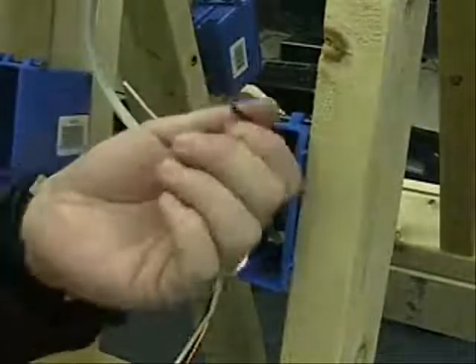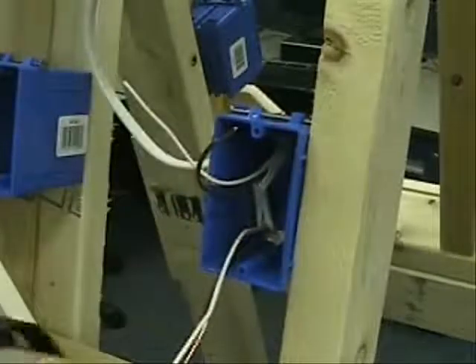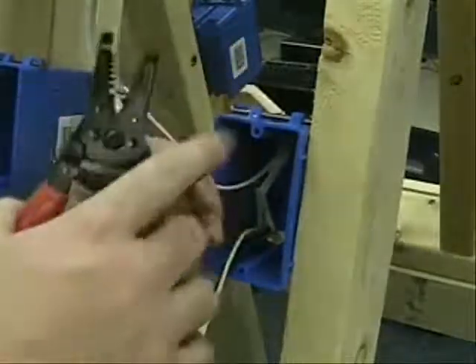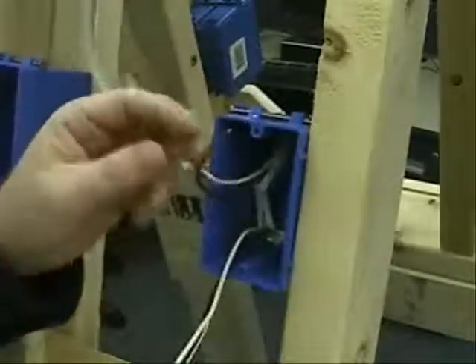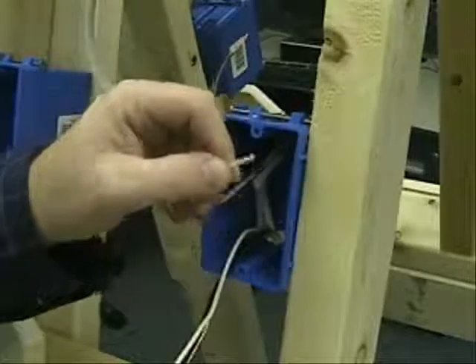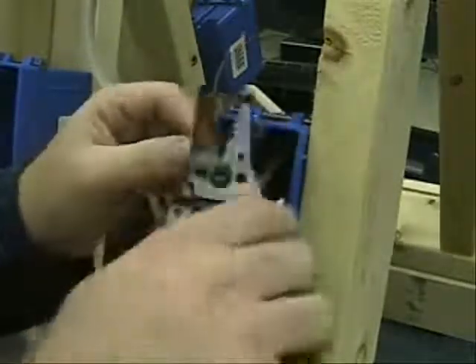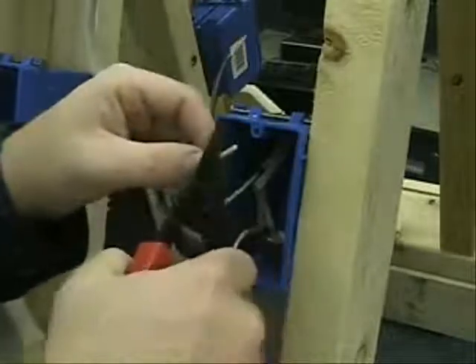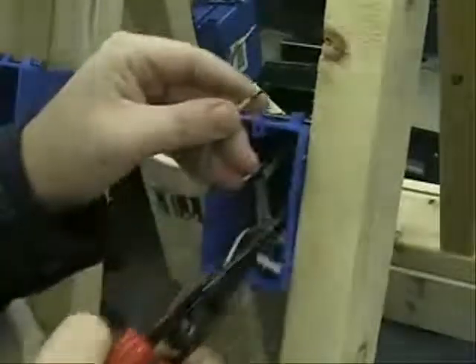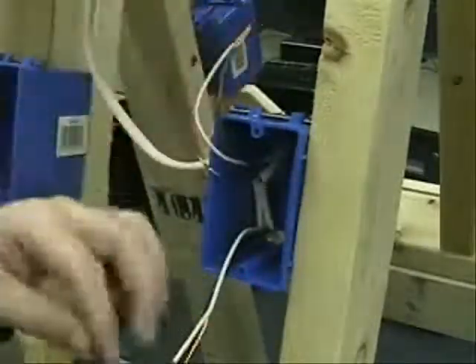Sometimes the insulation pops off, so that's why we have the safety glasses on. Try your best to drop all of your garbage right into the little tool bin built into the trainer. One other note: the end of this wire is very sharp — I've had many a cut knuckle and cut hand — so you really want to be careful when you're working with this. Once I've stripped that wire, I'll put it out of the way, take about a half inch on the next one, squeeze it between the strippers on the 14-gauge, give it a little wiggle, pull it up, and there we have a perfectly stripped wire.